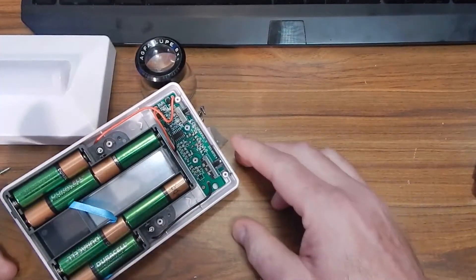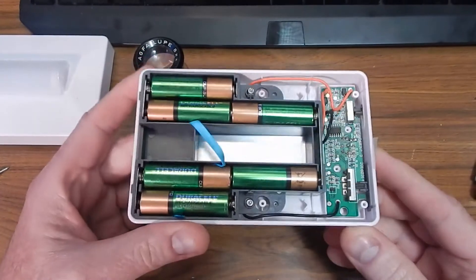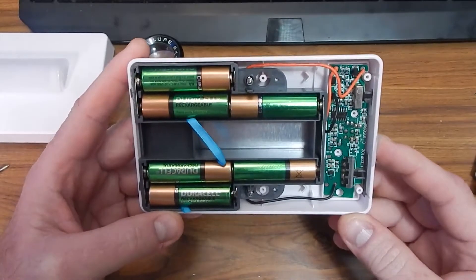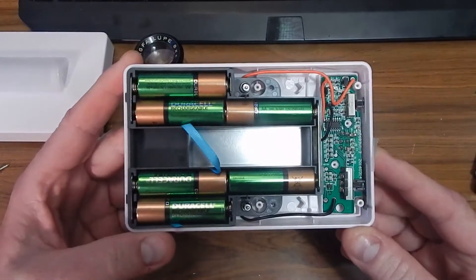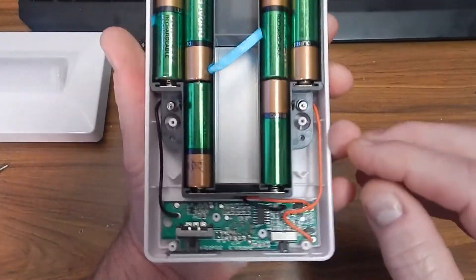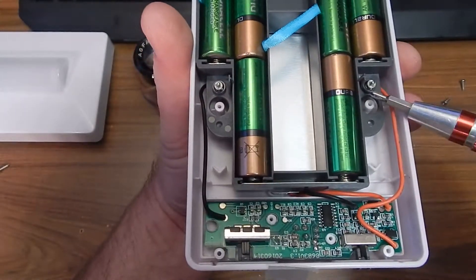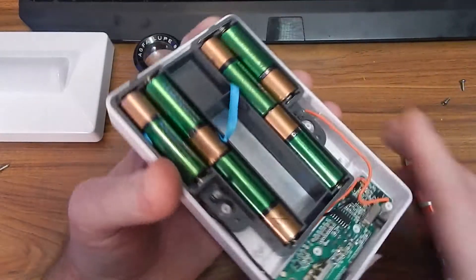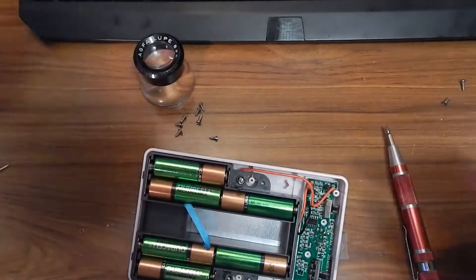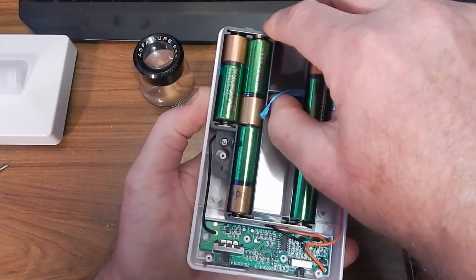Very well made and very good performance — you'd like it if you bought it. Let's take a look at the inside. You can see six double-A's. In this case you need all six to make it work — sometimes they design these things where you can put just three in because they're paralleled, but not here. That little stand in the back works via two springs that give you the nice detents. They did a good job with that. Nice little heavy wiring too — the gauge is probably a little heavier than it needs to be, but that's good quality.